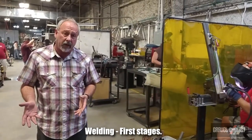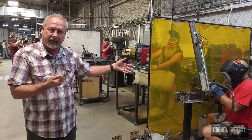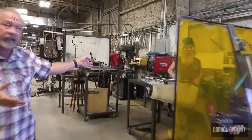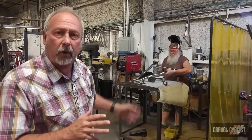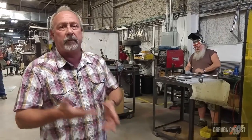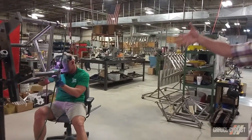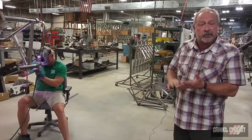Now we're in the first stages of welding. One of the first things we do is weld the bottom bracket shell into the seat tube. We do that so that 100% of the bottom bracket and the seat tube can be welded together. If we wait to put the down tube in place, it covers part of the seat tube/bottom bracket connection and now you can't weld it — if you don't weld that, you're going to have creaking and failing. On down here is where the front triangle is being tack welded together. A tack weld is just a little drop of weld, just enough to hold it together, confirming the geometries are correct and all the parts are fitting together properly before it moves on to finish welding. Now it comes over here to this fixture station where it's finish welded — it pivots and rotates to get the welder and the frame in the correct and most comfortable position, so that the weld is both strong and aesthetically pleasing.